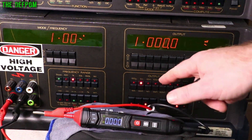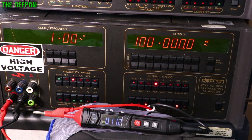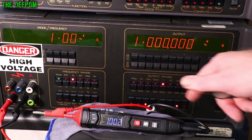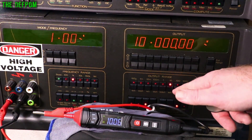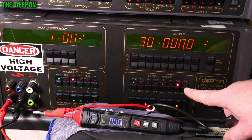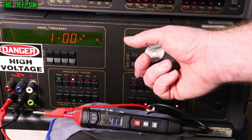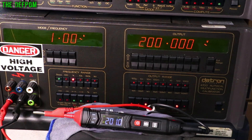Now doing the AC range. At 1mV and 10mV — can't see it. At 100mV — there we go, 12 counts out at 1kHz. At 1 volt — two counts out. At 10 volts — six counts out. At 100 volts — five counts out. At 300 volts — 15 counts out. That's pretty significant. At 500 volts — three counts out. At 200 volts — 10 counts out. It's a bit erratic and not very linear.